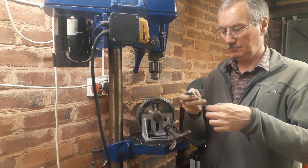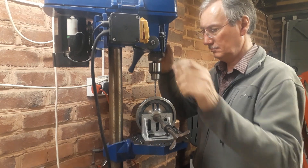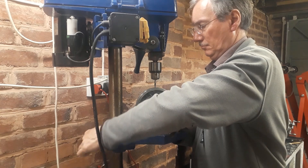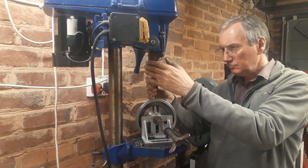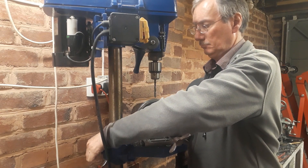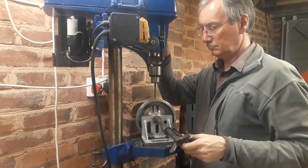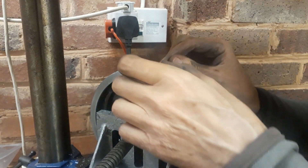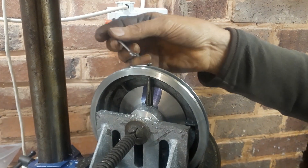I'll set the pulley up now ready for drilling and tapping. I'm going to start by drilling a pilot hole for the quarter-inch UNF set screw, and that pilot hole goes right through the rim of the pulley and then into the boss in the center. What I'll do then is open up that hole to be a clearance for the tap, which will then provide support for the tap as I tap into the boss at the center of the pulley. Tapping was a little bit tricky — I had to use a BA spanner to grip the tap, just sufficient height there above the rim of the pulley — but it was successful and we got the job done.